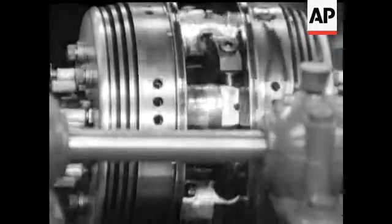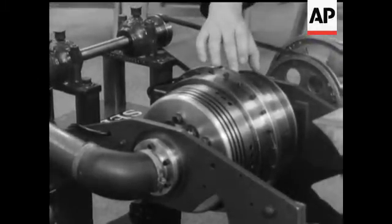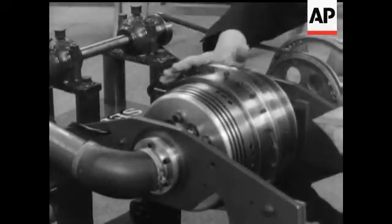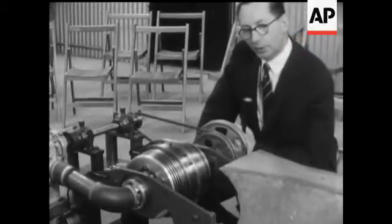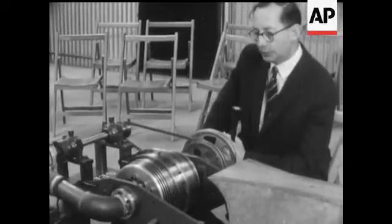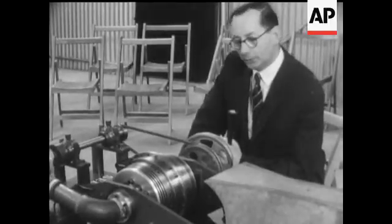We have on this side six pistons, and on this side six pistons, six sparking plugs. No reciprocation — all rotating in the same direction. There are no cooling problems, no water jackets, no water pumps. The engine is its own distributor; it is in fact its own flywheel.